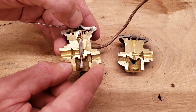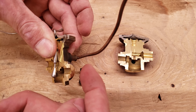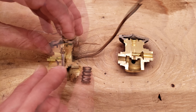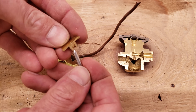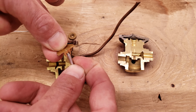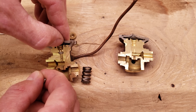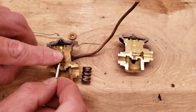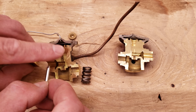So you have the three pressures on the TXV: bulb pressure downwards, external equalization line pressure upwards, and spring pressure upwards. That small brass piece pushes up against the diaphragm to flex it. There's also a seal inside the TXV — be careful not to melt it while brazing the valve in.